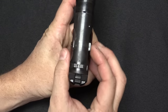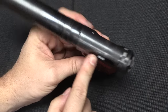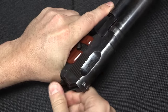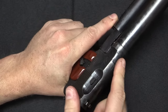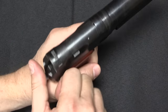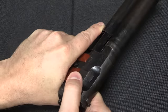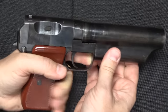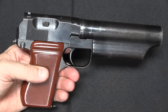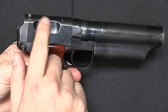We have one more control: a toggling switch in the breech block. What this does is lock the breech block in an interesting way — I can always open the breech no matter what I've done with this latch. However, it will only cycle when fired if it is in this position, with a little 'A' visible there. If you put it over into the other position on the right, you can cycle it manually, but the gun will stay shut when it fires. Which means you don't have the action noise — which doesn't sound like a lot. But if that's the only thing you're hearing, because .32 ACP is a very small volume case and this suppressor is probably pretty effective at quieting it down, that leaves the action noise as a pretty substantial thing. So they wanted to have the option to lock the pistol.